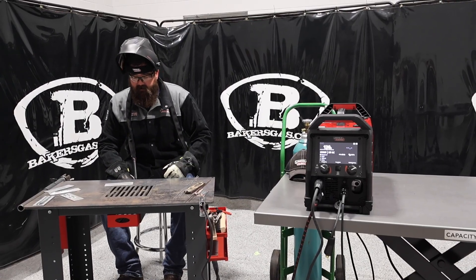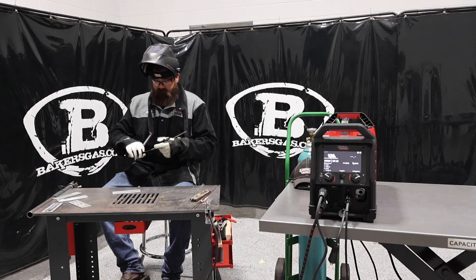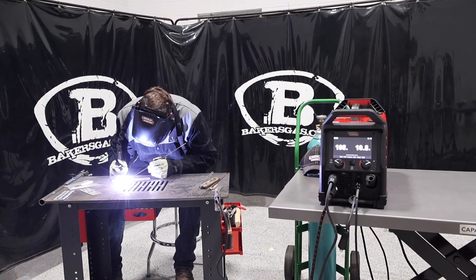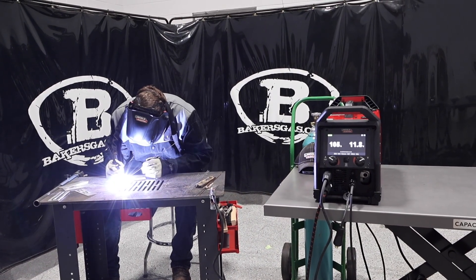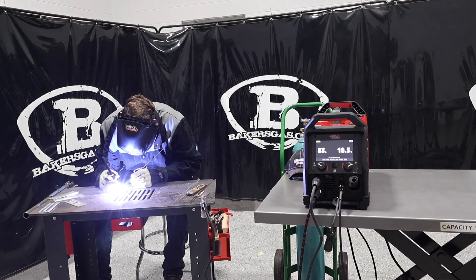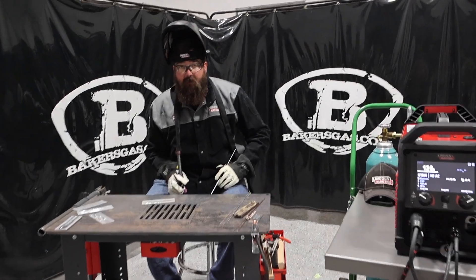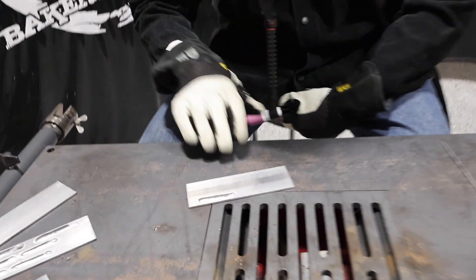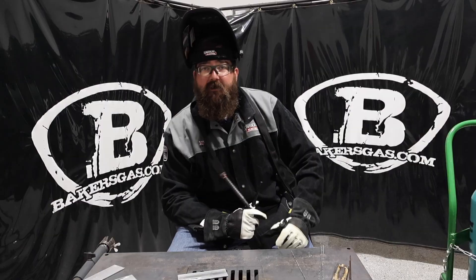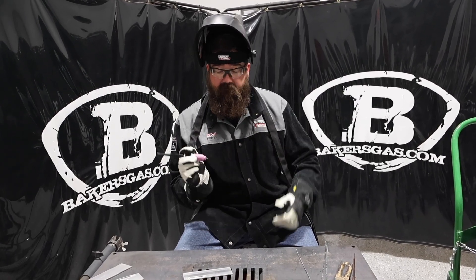I've got my aluminum and filler rod — just some 6000 series aluminum. Let's run it. Not bad at all. Very crisp arc — surprising, I was expecting it to be a little softer, but it welded pretty nice. Laid a good bead, everything wet out nice, heated up quick. We're throwing 120 amps at that piece, so that's quite a bit. Really good. I like the TIG torch — super nice. Like I said, it flexes too, so if you've got to hold it a little differently, that's pretty awesome.